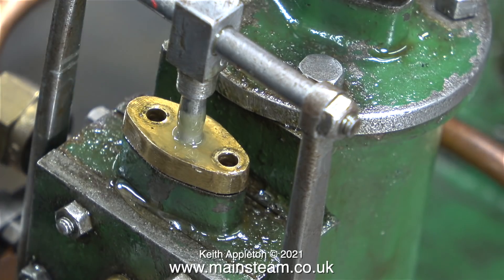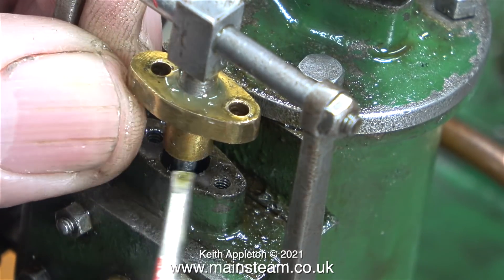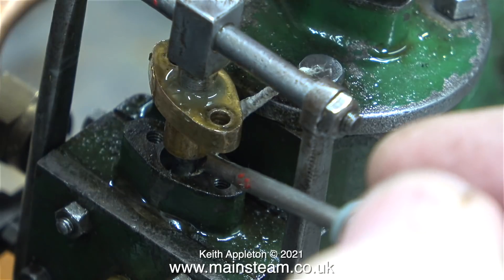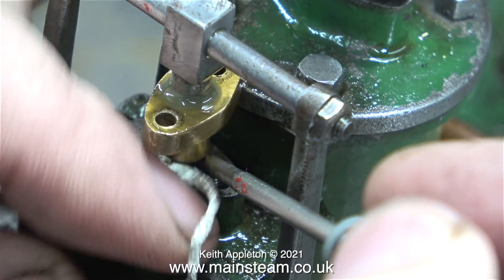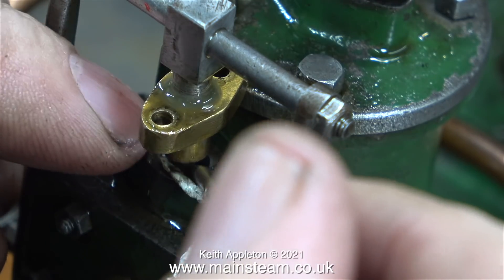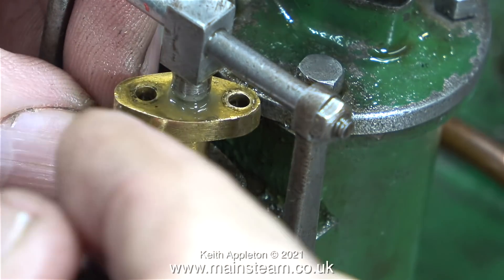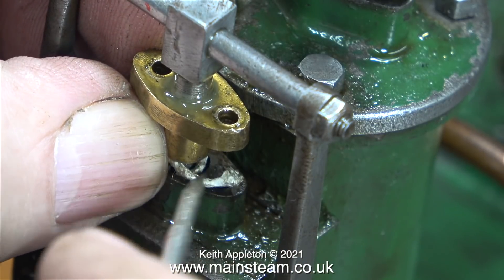I removed both of the screws and gently prized the flange out of the way. I would normally pack the valve chest gland once I had removed the valve chest, which I'll be doing very shortly, but I thought I would show the principle of how to pack the gland without removing the valve chest. There's not much room to work and it's quite a fiddly job. Initially I put a small piece of gland packing in, but it wasn't enough, so I fitted a longer piece of yarn. I used quite a bit more gland packing the second time round, and it still didn't work.